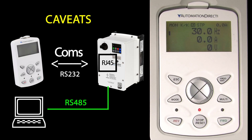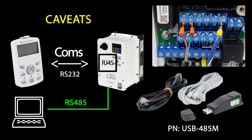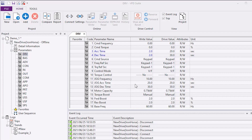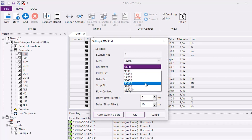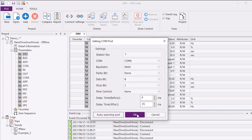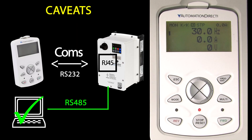The external keypad uses the RJ45 RS-232 port on the drive, which means you can't plug the configuration cable in and connect to the VFD Suite software – at least not with RS-232. The good news is you CAN connect via RS-485. I like to use a USB-to-RS485 converter, connecting the flying lead cable's green wire to S- and the red wire to S+. In the VFD Suite software, before hitting connect, go to settings and select the COM port the USB-to-RS485 converter is plugged into. Importantly, you have to set this to 9600 baud – it defaults to something else, so don't assume it is already set. You can then use both the free VFD Suite software and the remote keypad at the same time.